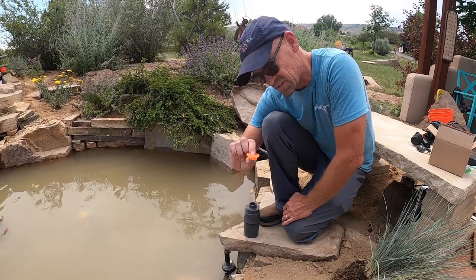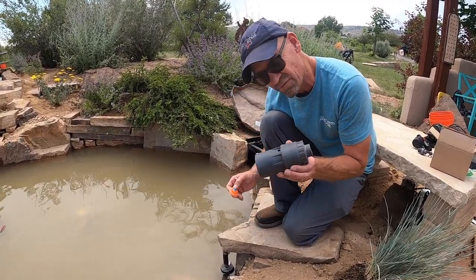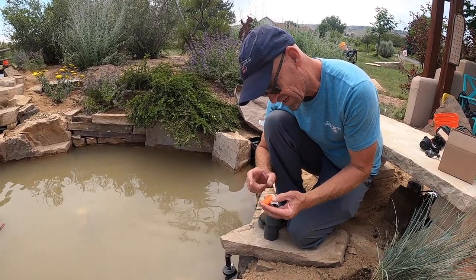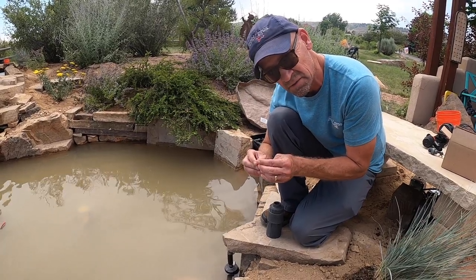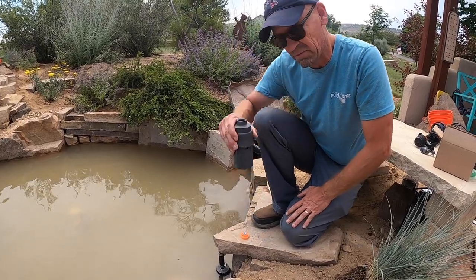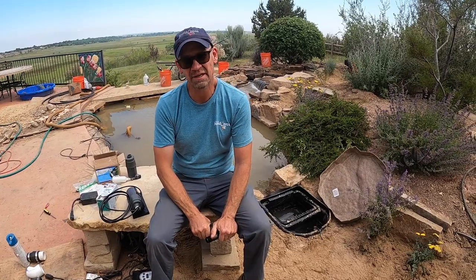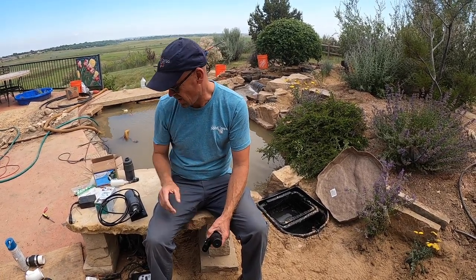Just to describe a little bit — this is basically the diaphragm that shuts this Hudson valve on and off. What happens is that dirt and debris actually get within this diaphragm and it really keeps a seal from closing. So one of the things that we want to introduce is the Y strainer. On any good system, we actually want to increase the reliability of the autofill.